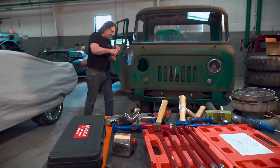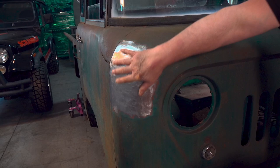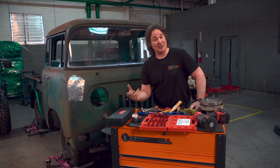This is what we started with a little while ago, and this is what we have now — ready for a light skim coat of filler and some paint. We didn't do any welding, we didn't do any grinding. All we used was some hammers and some dollies, a little bit of time, and a little bit of blood — something everybody's got. So don't tell me you can't pound your own dents out, because we've just shown you that you can.